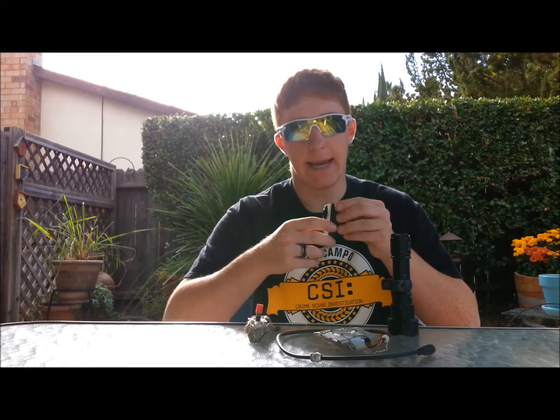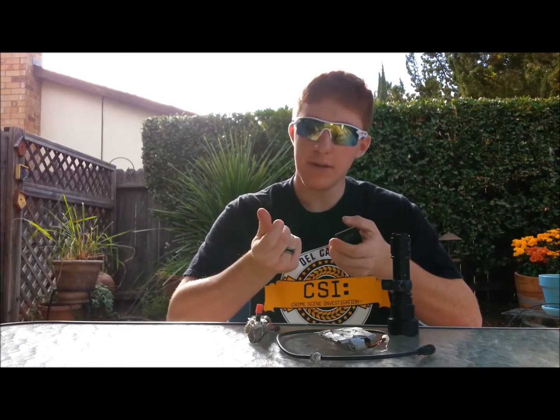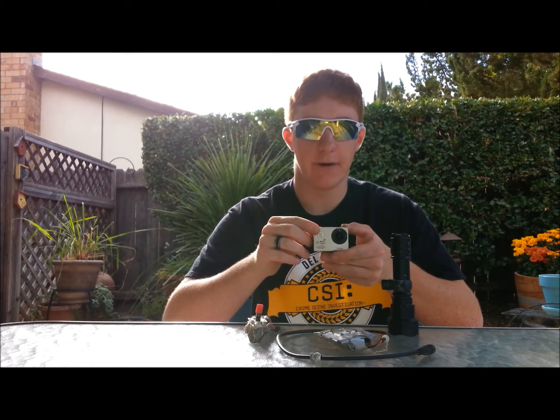But just going over it real quick, all you have to do is take off the front plate of the camera, take off the little ring around the lens, use a pair of vice grips, unscrew the lens. The lens is out, you chip out the infrared filter, you clean it up, you screw it back in, you put the camera back together. Now you have an infrared camera.